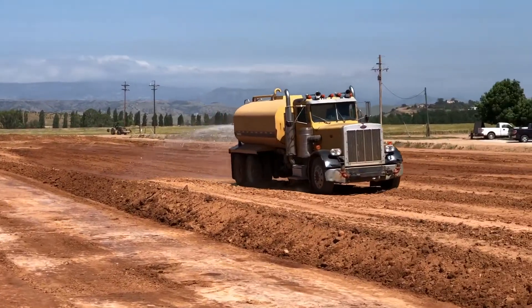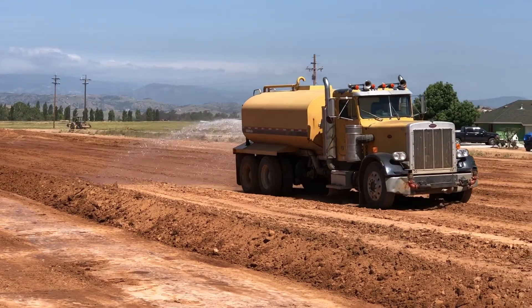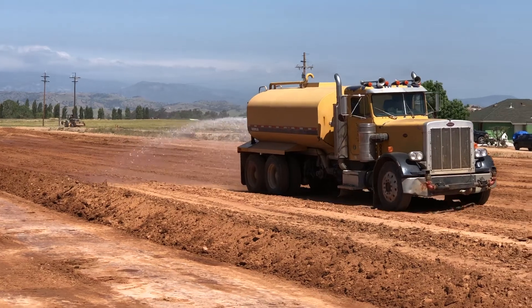Here's a small but important clip: this water truck doesn't just serve the purpose of dust control — it also serves to maintain haul roads, and typically this will be done with a blade or motor grader as well. The better your haul roads are for these scrapers, the faster they can drive and the more productive they can be, which in turn saves money on budgets and allows your company to make money.